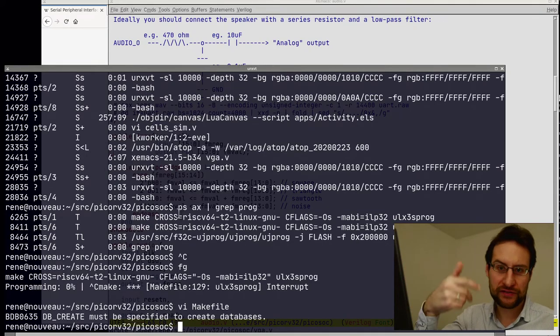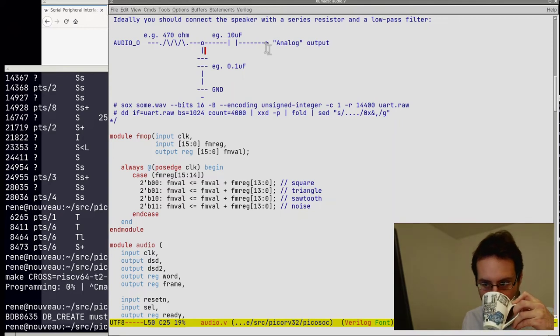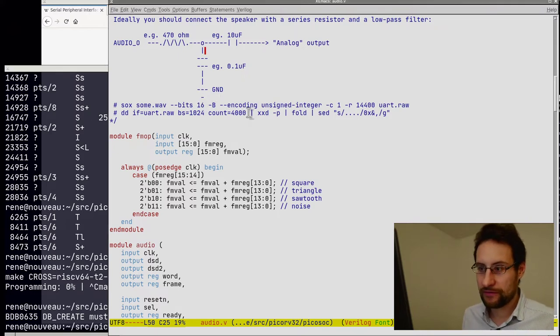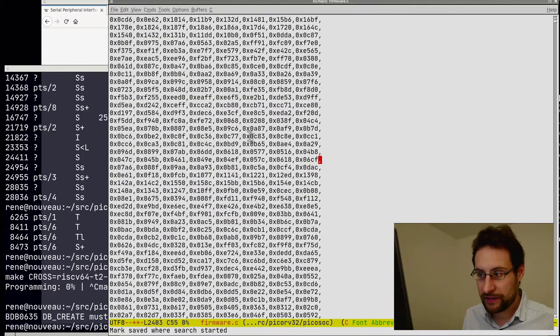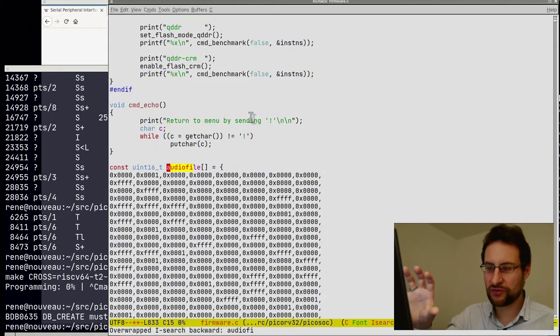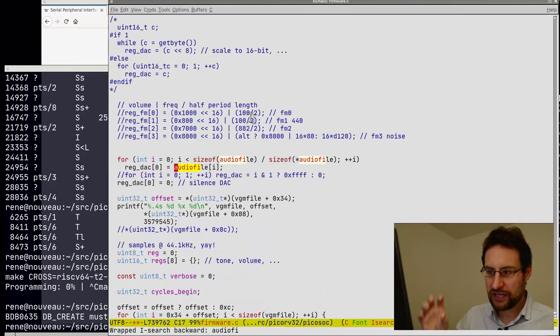I commented the wrong line out. Unfortunately now we're also modifying the firmware again because it's already erasing — the area where the RISC-V code lives is already erased to all bits set to 0xFFFF. That is exactly what I wanted to avoid. So we can also make the firmware stereo now. We need to handle the DAC commands: copy the data and write to both DAC memory-mapped IO positions, since stereo is usually interleaved left-right-left-right.